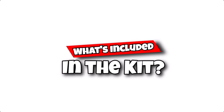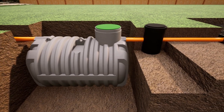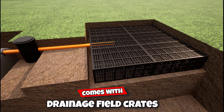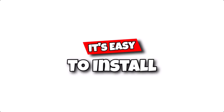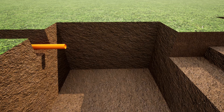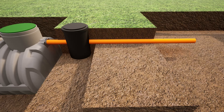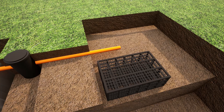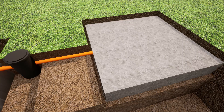What's included in this amazing septic tank and soak-away kit? Well, it comes with absolutely everything. It comes with a heavy-duty shallow dig septic tank, no concreting required. It also comes with a German inspection chamber, all the pipework and all the connections, and the septic tank drainage field crates with free membrane. And the best part is it only takes a few hours to install. You put the pipe in the first trench from the house into the first hole, then you put the septic tank and connect the pipe to it. Then you connect the inspection chamber to the pipes, which just slots straight into the septic tank. Then you insert the drainage field crates and put the pipe from the inspection chamber into one of them. Then you cover with membrane - job done.